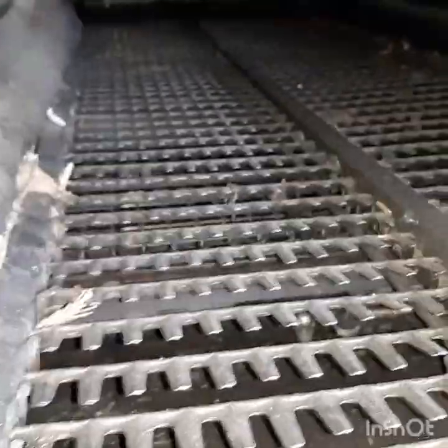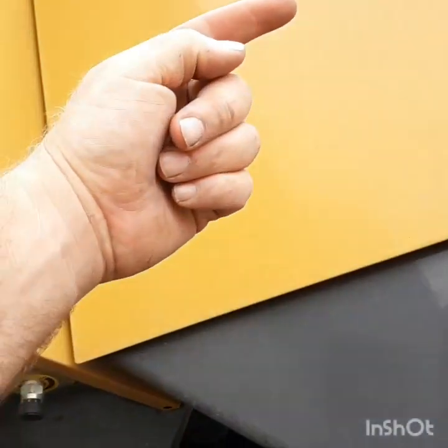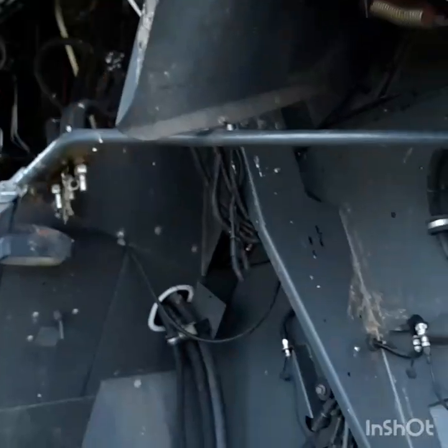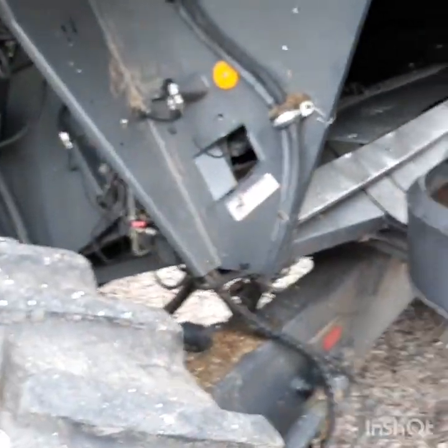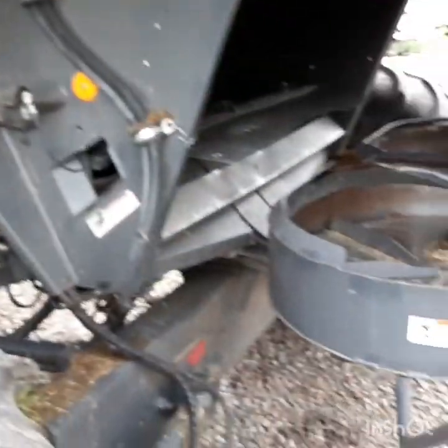The sieves were open about that much — and that rye was as clean as seed. I like that I can set the rear up different from the front and then it's all automatic from there on, but it allows me a little control, a little fine tuning — pretty simple system. Again, no augers up here at this end. Some of the competition ran their shoe augers all the way up front and then had reverse sliding to pull that chaff back underneath the walkers. This is a very simple system and it works very efficiently.